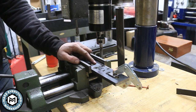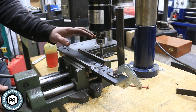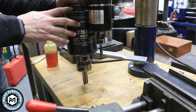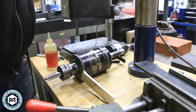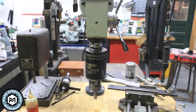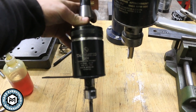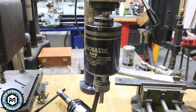This is the real test — three-quarter-16 thread, the biggest size tap I have. It's going to require the biggest tapping head I have, which is this monster — the Tapmatic 90x, which will go up to an inch and an eighth. Let's get this chucked up and try this three-quarter inch tap. You can see just how big the Tapmatic 90x is in comparison to a Tapmatic 50x, which does up to a half inch. The 90x will do from half inch to inch and one-eighth.